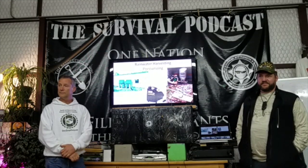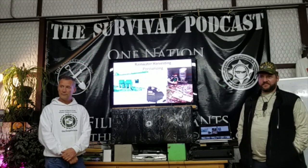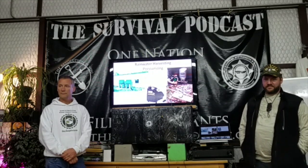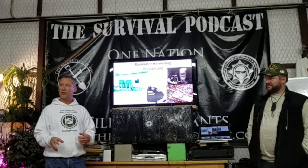With that one, just as an idea, I know that you've got the pressure tanks where you run them all the time. It's exactly the same as that. It makes perfect sense. But if you've got a nursery or something to run and you've got power issues, you can probably just run a little header tank up. I don't know what size, but even an old IBC. If you put that up on a stand while your pump's going, that gives you just that extra buffer up there. Yeah, that's a wonderful idea. But like I say, normally we're never out longer than half an hour, and that gives me an hour.